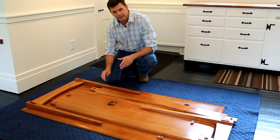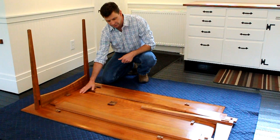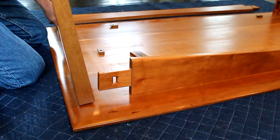I designed the table to be held together with a mortise and tenon and a locking pin — a through mortise and tenon. One side of the legs has the apron attached; I stand that up on the bottom of the tabletop, then take the other apron — you can see the through tenon here — slide that through the mortise, and then a rosewood locking pin fits into the tenon and locks the leg in place.